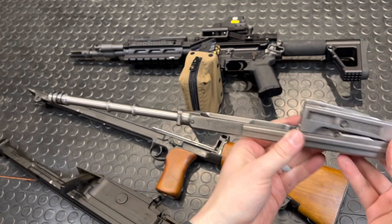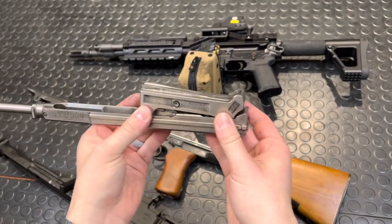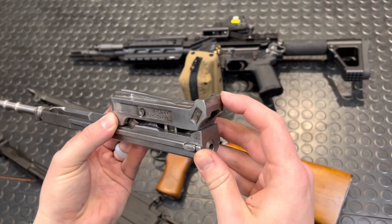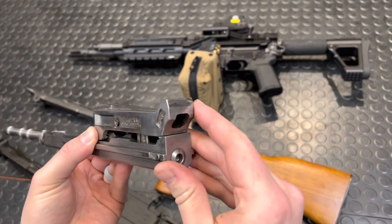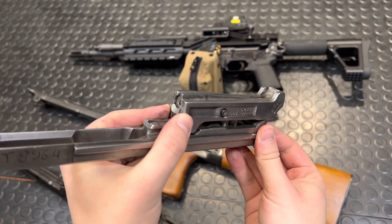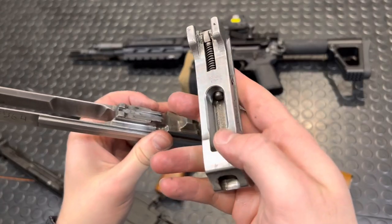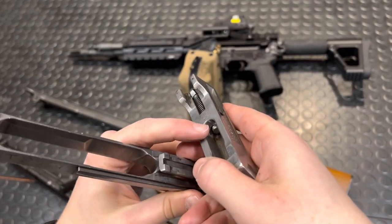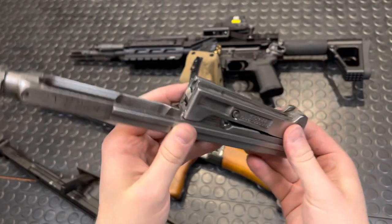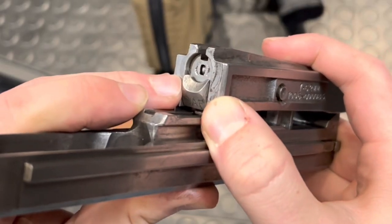Here's your internals — it's this simple. Massive piston, and here's your bolt. This is when it's cycling back, and when it cycles up, this surface here pushes the bolt up against this locking shoulder right there. You can see that machined surface rests up against the locking shoulder in the gun. That was unexpected — but at this point I can show you there's your spring-loaded firing pin back there. That hits against this surface right here, pushes that firing pin forward, and makes the magic happen.